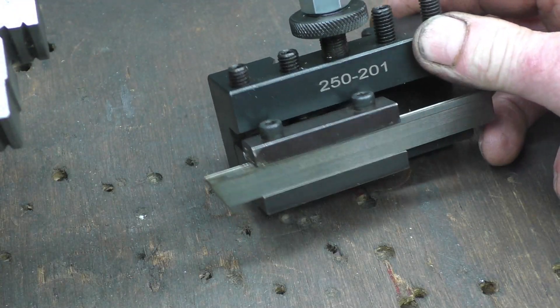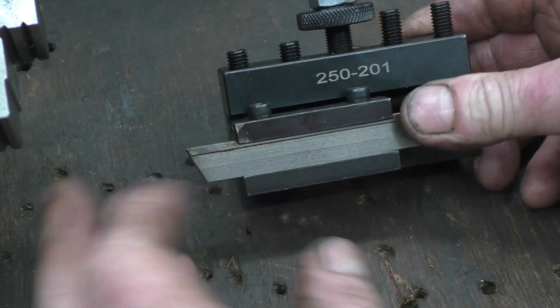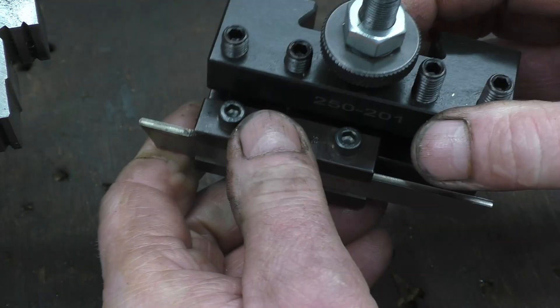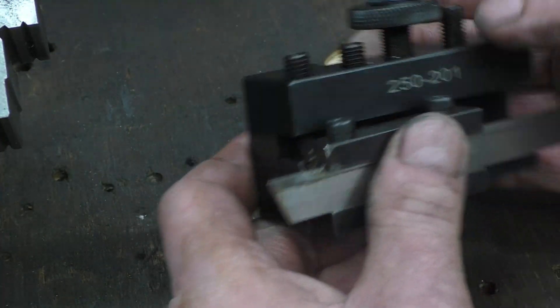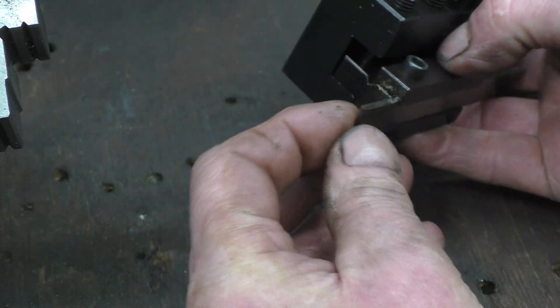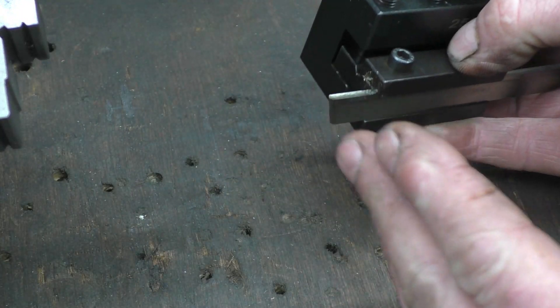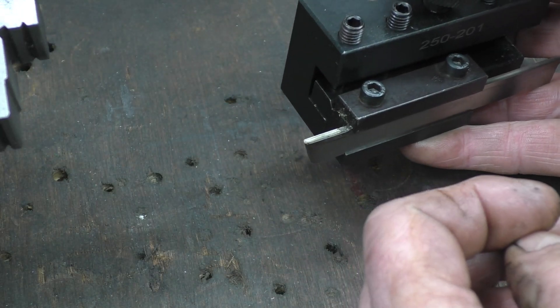This is more the hobbyist type of blade — that's a high speed steel blade. There's a section on the end that fits into the big tool holder on my lathe. The end is actually ground — not to a point, but it's got a curve on it. I tend to grind mine flat but at a slight angle, which I'll show you a little bit later on.